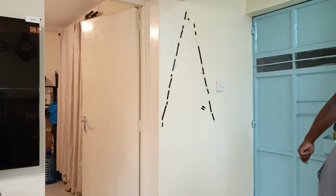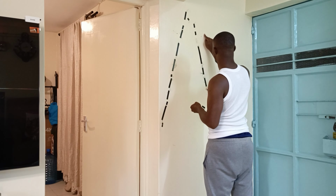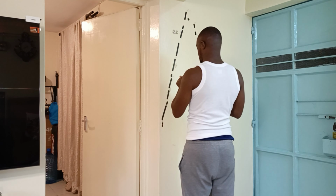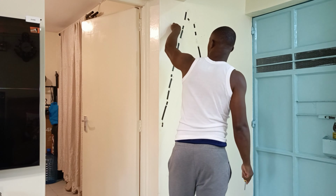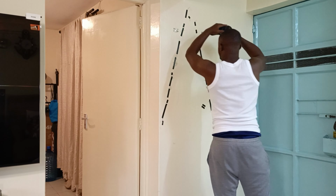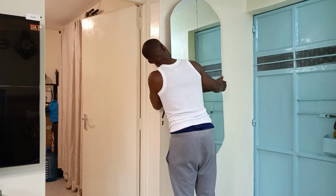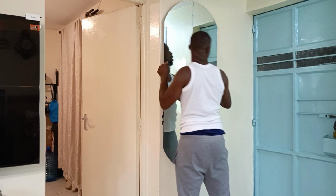Thereafter, pick the screws that we are going to use. I prefer longer screws as they will ensure a stronger hold on the brackets. Do the same for all wall flush brackets. Pick the glass up and in a downward fashion, place it on the wall hangers and confirm whether or not the glass looks okay.